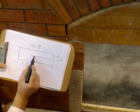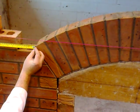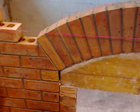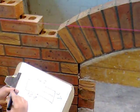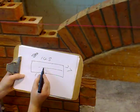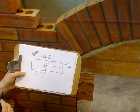Now we have to get the next measurement to position this last point. This time we measure across from that point — the corner point of the voussoir. Measuring across, we get 108mm. Take away 10mm for each joint — 108 minus 20mm gives us 88mm. So 88mm is the measurement we are looking for. We then join these three points up together and that will give us the measurements for the birdsmouth.